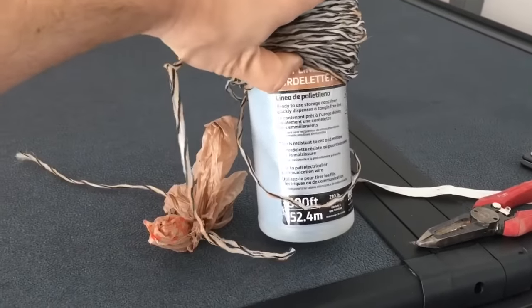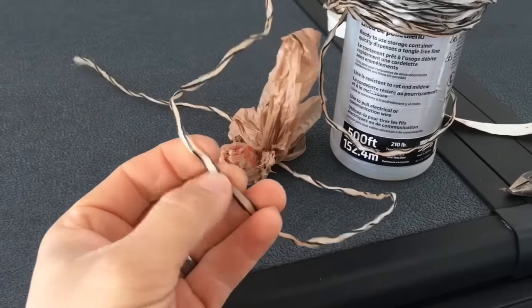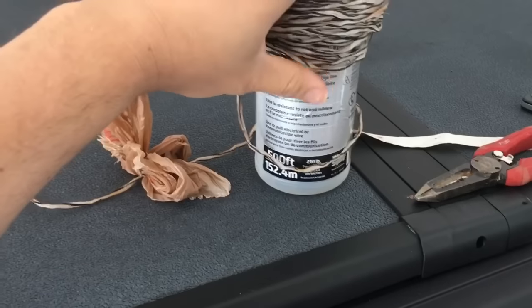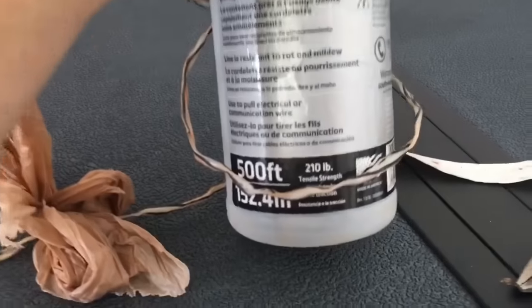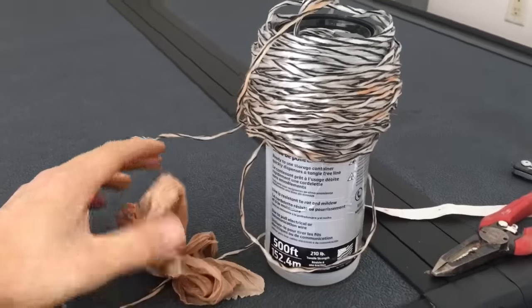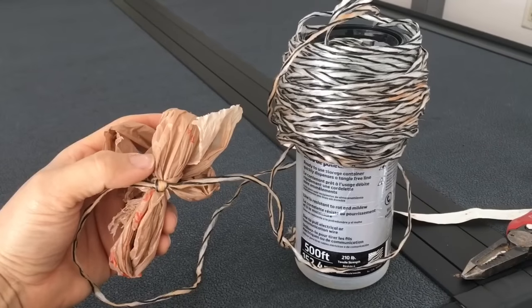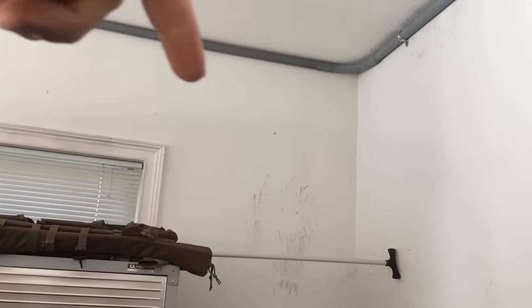I'll use this poly line — it's a Southwire product, but it's poly string and it's got a flatness to it. That flatness is so it doesn't destroy the conduit — some strings out there will cut around the 90s as you're pulling. This is available at Home Depot and Lowe's, just electrical pull string. This is 210 pound. If you're doing a really big pull, we would suck the string through and then put a mule tape on it, but on this one I'm just gonna suck this through and pull it right through myself. The reason you want the flat string is that a rounder string could actually cut the 90 as you pull along it.